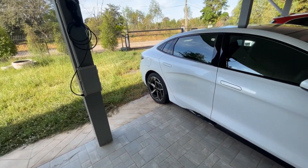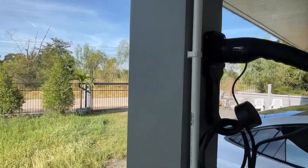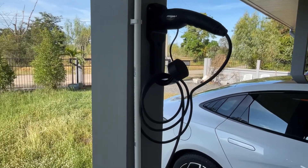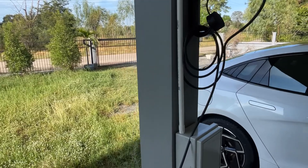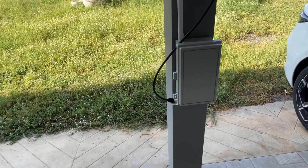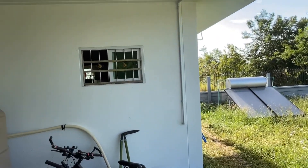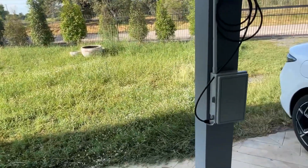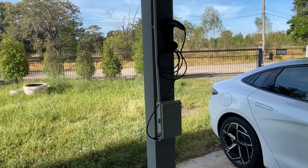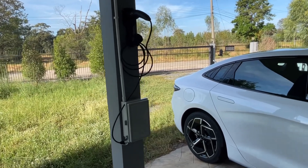On the post here you can see a CCS charging plug — it comes with the car — this is the vehicle-to-load adapter. I've installed a box here and trunking going into my mechanical room, because this is going to be a permanent setup. I'll be drawing power from the car at times when, due to weather, I haven't been able to charge my battery sufficiently.